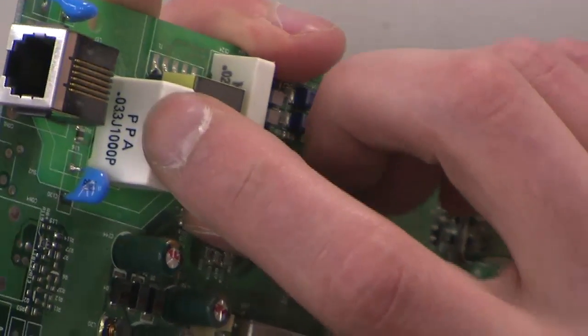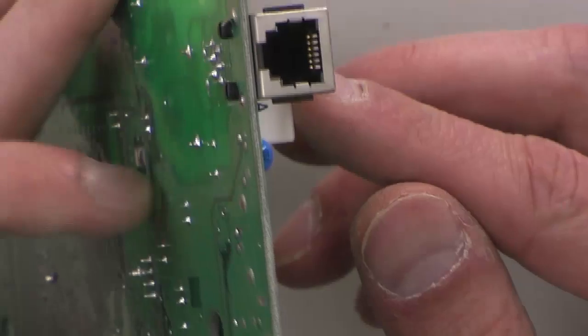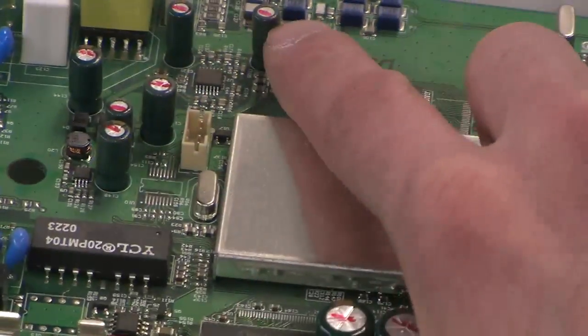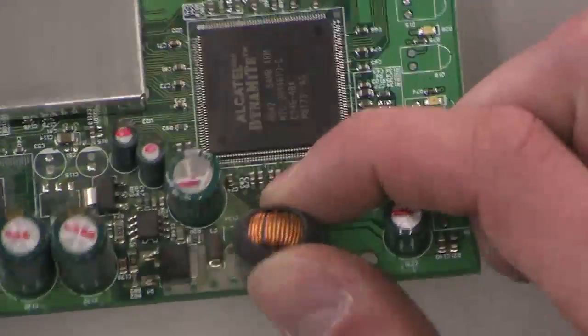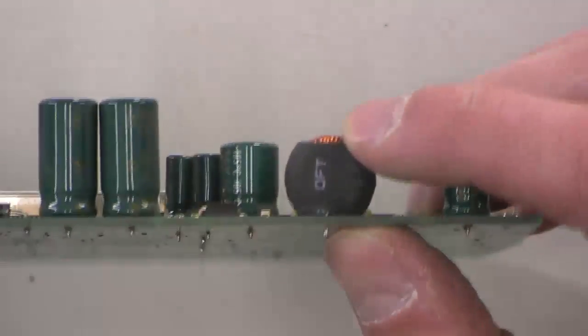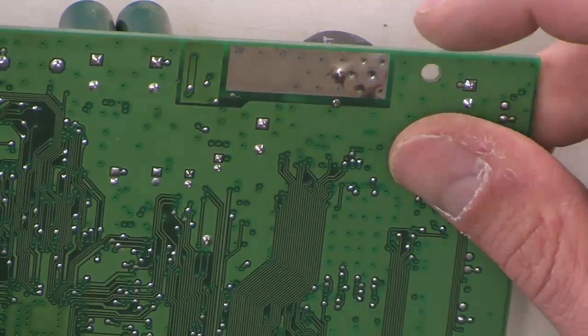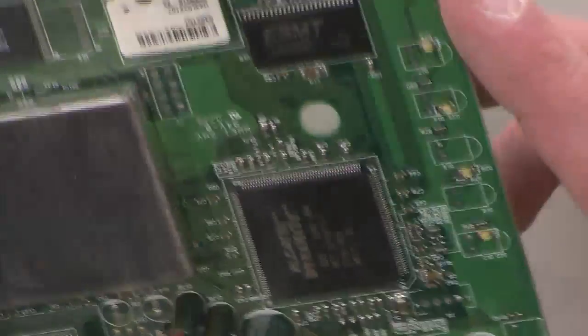That's really big - I'm going to say that's a capacitor. I thought it was a relay at first, but the number on there is 0.033, so it's a really small capacitor. On the bottom there are only two connectors, confirming it's a capacitor. These big can things are all capacitors - probably used for filtering. We've got a coil here. The way to tell if it's a transformer or a coil is look at the bottom - there are only two electrical connections, so it's only one coil of wire, which tells us it's an inductor, not a transformer. If there were four pins or at least three at the bottom, it could be a transformer. It's got a bit of heat shrink around it and it's probably a filter.